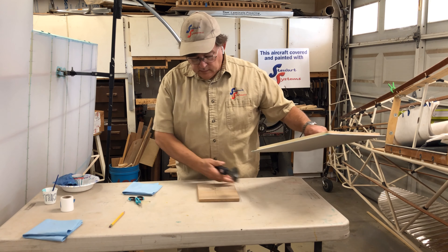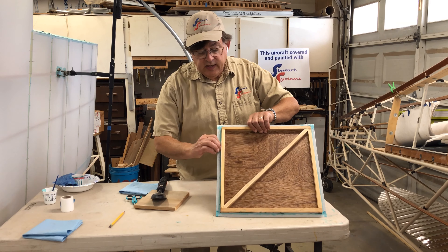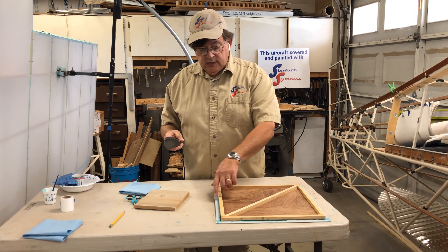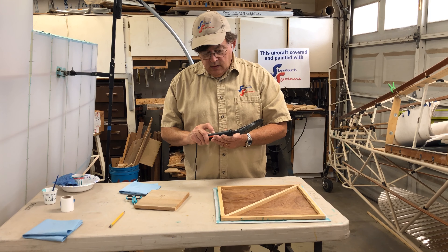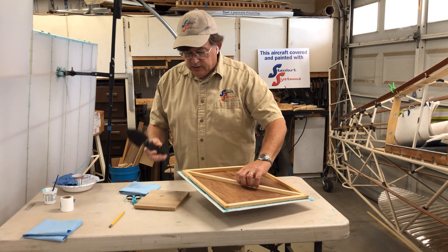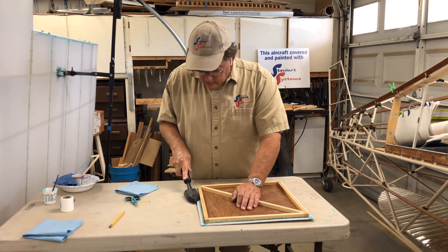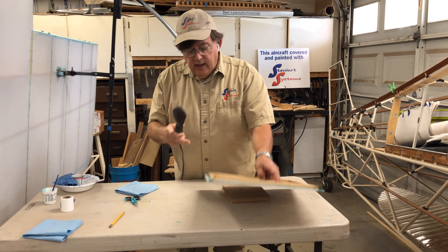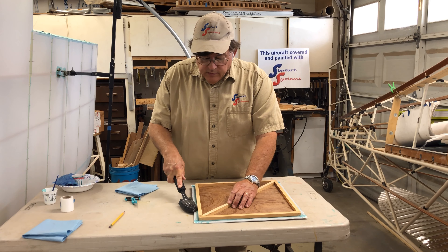You can see it getting a little bit darker where the glue is bonding. The wood on the side here is wicking off a lot of heat, so I'm going to crank this up to about 275. I can continue working while the iron reaches that temperature. A little more pressure on here — not worrying about the edge itself yet, I'll come back and get that momentarily. I've got it pretty well down, no bubbles, no wrinkles — it's nice and flat.